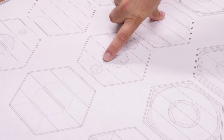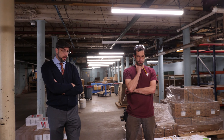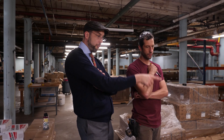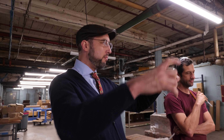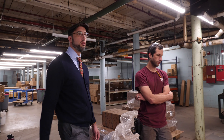I really like this shape — it's just like hex with the little scallops or coves. It echoes the motif a lot with this kind of border. I don't love the circle on it but I really like the border on this guy. We still need to get the shield designed: oak burl background, wenge tree, and then silver stringing to cut it out from the background. Hunter could move forward with four of the aprons — we're locked in on four of them, 66% done. Next week I want to have this design done, 100% done on this table.